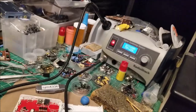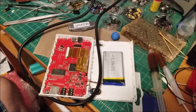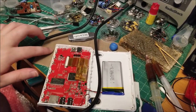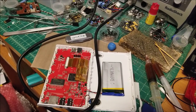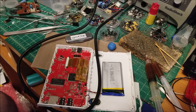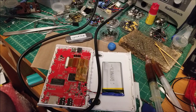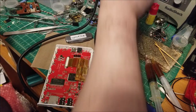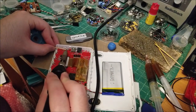Not the cleanest, and the switch was already destroyed so no loss there. My temp right now is at 680°F. Depending on how thick the board is, copper thickness, and type of solder, you might need to increase that temp. I wanted to keep it as low as possible so I wouldn't risk lifting any of the pads. It looks pretty good — doesn't look like I lifted anything. So we're going to go in with some solder braid and just clean all the excess old solder off.